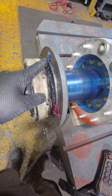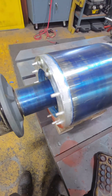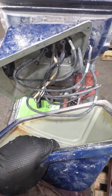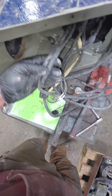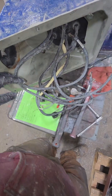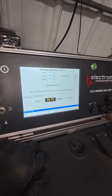I also notice that they're pumping two different colors of grease in here — we've got blue and we've got red, and when you mix them together that makes purple. Purple grease definitely doesn't work as good as blue grease. Just to be sure that our winding is okay to put back in service, we're going to remove this pecker head cover. We've got some really nice long leads inside this box, which is good because over the years the electricians are going to keep cutting these things off. We'll throw it onto the winding analyzer that we finally got back after it failed us.